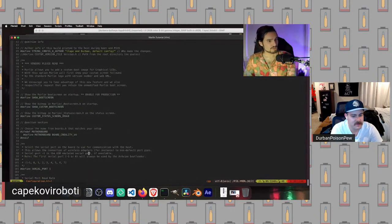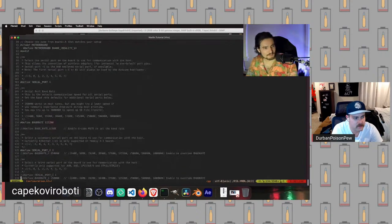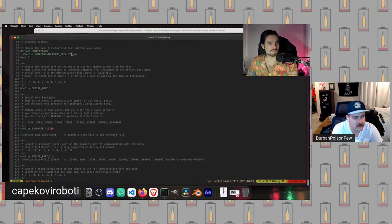Then we want to make sure that we're showing our boot screen, right? So boot screen looks good. Our boot screen is custom, so we want this to be enabled. So again, remember that if it's like this, that means it's disabled. And if we delete these two characters in front, it will become enabled. So right now we are using a custom status and boot screen, which is good. We're using our Creality version 4 motherboard.